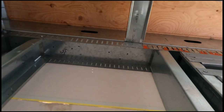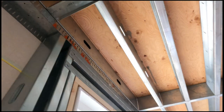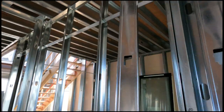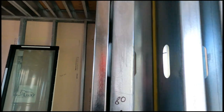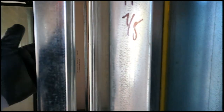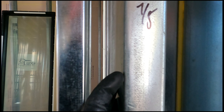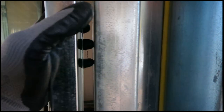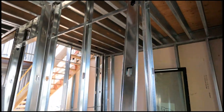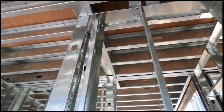You can see how I cut the top track so the drywall can slip through as well — it's got a space and the drywall can carry straight through. This one here is a floater, so the exterior board will come in and wrap here, or stop here at least. The floater helps lock that in. Everywhere at the top, there's three-quarters of an inch everywhere for your drywall to slip in.